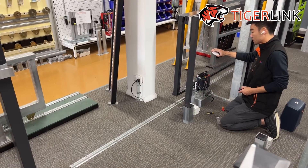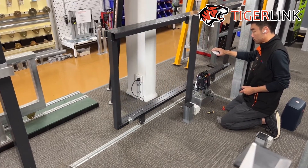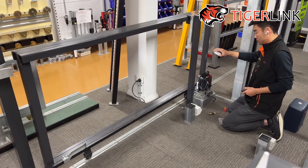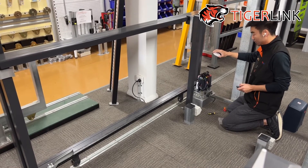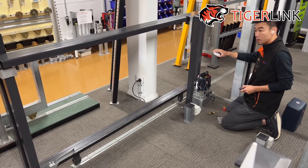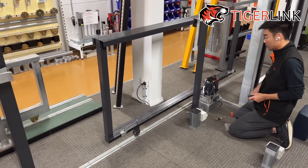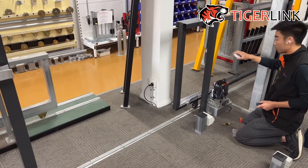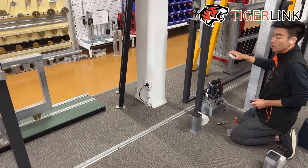This is when the gate is closing. With the factory configuration, the photocell will also work during opening. This is opening — once the beam is broken, the gate will stop and then continue again. I'll show you how to change it to the configuration where the photocell will only work when the gate is closing.